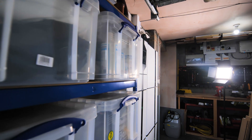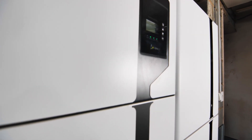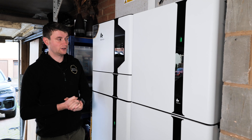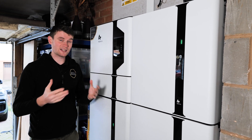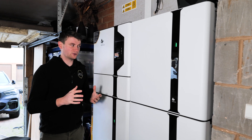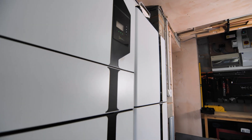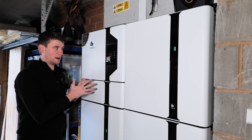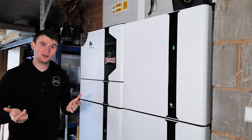You might be wondering why they need so much storage with only five kilowatts of solar. Since the original installation we came back and added the remaining battery storage — this is the maximum for the Smile 5 system. The customer wanted longer backup runtime in the event of a power cut, so a large chunk is reserved as a backup system for the circuits in the backup board. It's currently at 98% charge because the customer charges it overnight on the off-peak tariff.